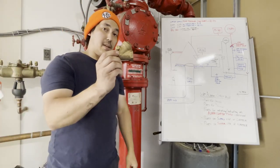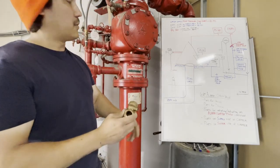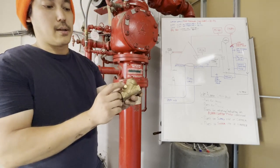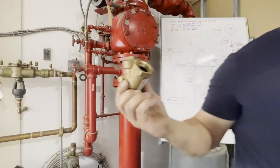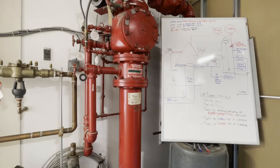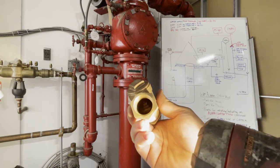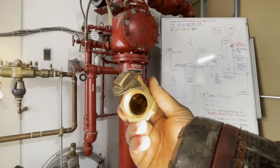This is just a basic three-quarter inch swing check valve. There's a hinge on it on the back side, and you can always tell it's a swing check if it's got a bolt hinge right here. You can kind of see on the inside here — there's the clapper. I can push in on it from the back side and it opens up.